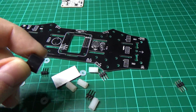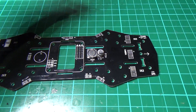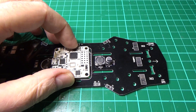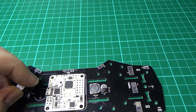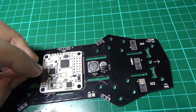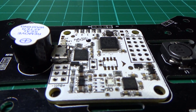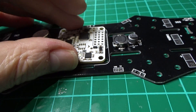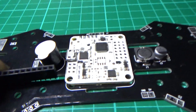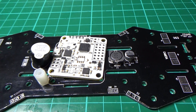You get a beeper — and a strong word of warning. If you're going to fly this and put a Naze on it, or put an external mag somewhere, when you fit the Naze on there — that thing is supposed to fit on like that. Two things I've noticed: you're not going to be able to plug your USB port in unless you raise it up. And these standoffs aren't going to be high enough, so I don't know what they were thinking or whether you're supposed to mount it differently.